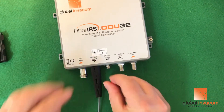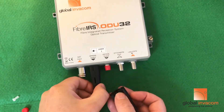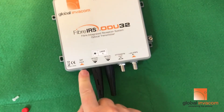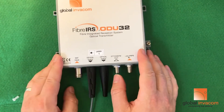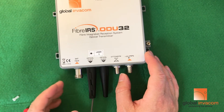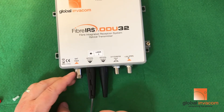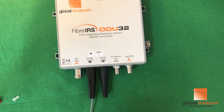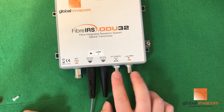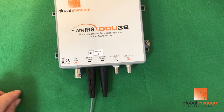If you're not going to use it, put the dust cap on and leave it on. For the N-type connector, it's worthwhile putting that on and using a self-amalgamating tape — it will naturally seal, but it's worth doing and bringing it all the way down to cover the boot of the connector. For the F connectors, they're weatherproof as well, but once you've made a connection, again use amalgamating tape to help with that.